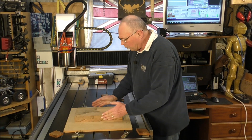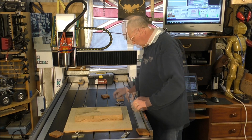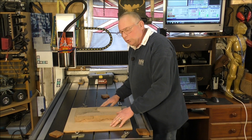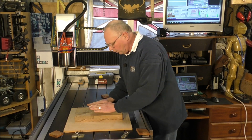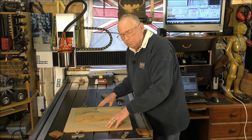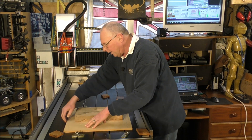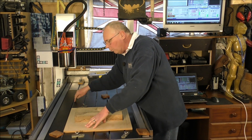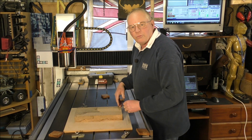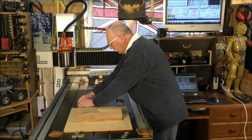I've got my piece of oak now secured on this piece of half-inch MDF. I'm going to set it up on the table — I know that this piece of oak is square to this piece of material, so I just set up this edge parallel with one of the T-slots here, and that's all you need. It's perfect. Now we'll just clamp it down.